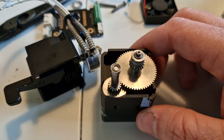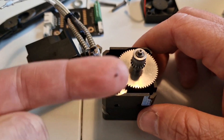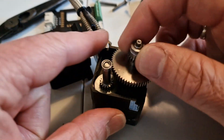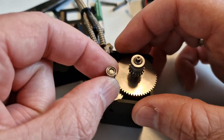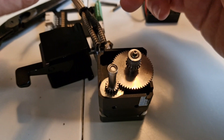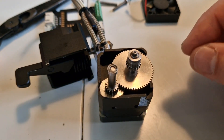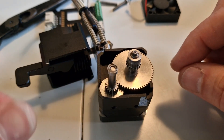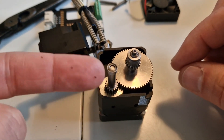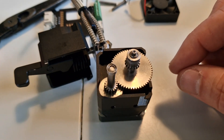I actually started taking this apart because I did just start having a weird issue, which turned out to be a little piece of filament that had got caught all the way down inside between these gears. It was causing it to jump out of place and cause a little skip, which would create these little voids — almost as though it would periodically skip a step in extruding. There were actually several little pieces throughout, so it's a good idea to maintain your extruder. Filament can get chewed up in there if you had an extrusion problem or a clog.